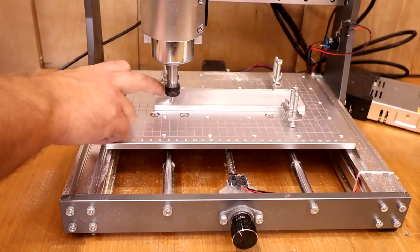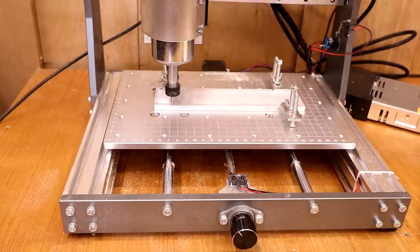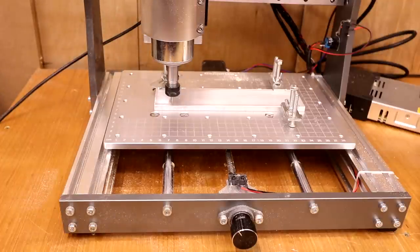For the final test, I've got a piece of aluminium bar that I'm going to try and engrave — and I should mention straight away this is my first time engraving metal. The aluminium bar isn't perfectly flat; I've sanded it as flat as I can get it but there are some minor high and low points. I'm taking the feeds and speeds fairly slow and steady: 0.1 millimeters per pass at a speed of 400 millimeters per minute. I'm going to be engraving a small JD logo into it, around 45 millimeters square.